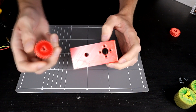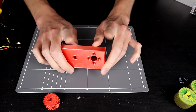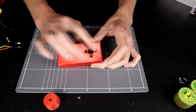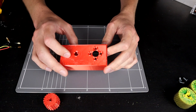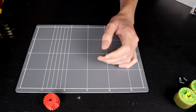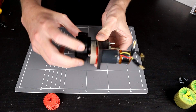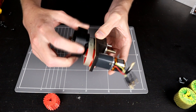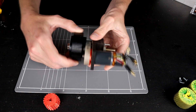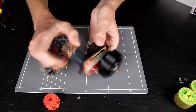At the end of that clip, I was having trouble getting these pulleys on. I printed a bunch of these pulleys out and just could not get anything working properly. I eventually did get it working only to discover that the wheel and the motor were pulling in against each other, meaning these were too far apart at 40 millimeters. So I then went to an even more rapid form of prototyping — laser cutting — and went up to the makerspace and laser cut a whole bunch of parts with different bolt hole spacings. Thankfully, now we have a setup that actually works, and the amount of play in here is nothing. There is no real pull back and forth between where the wheel sits and where the motor sits. This is going to be perfect. Obviously we would not be using a PLA pulley for the final design, but we actually do indeed have a working motor and wheel setup that we can now put into a featherweight.